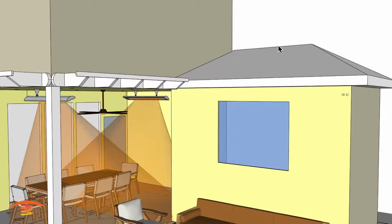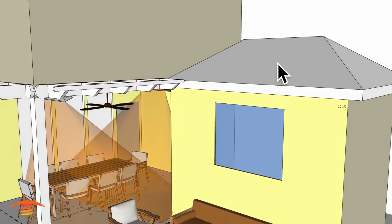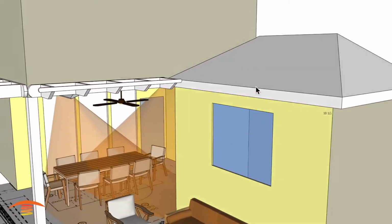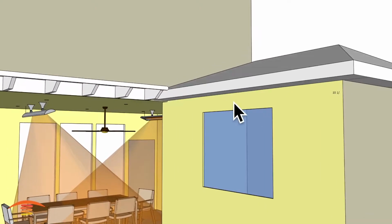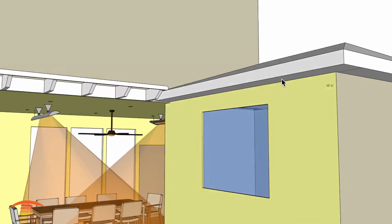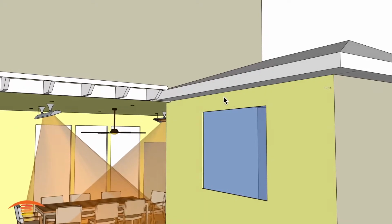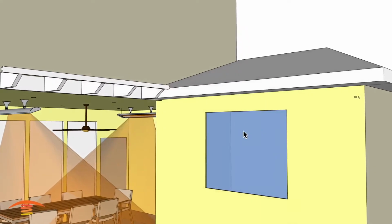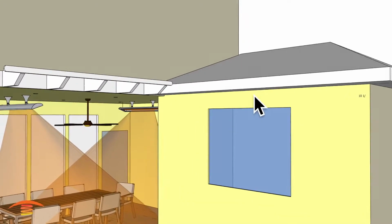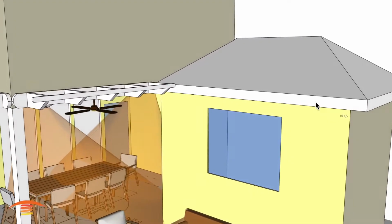It doesn't really matter, but there is also a rain gutter system here, and that would be an issue. That would be the only place that we can mount it. If we mounted it on the wall here, even if this eave is recessed, I don't have it recessed, I just have it flat right there. You couldn't put a heater right here without putting it in front of the window. So there's just no way to mount a heater here unless we put it on the eave itself, and that would be a problem with the gutter system.